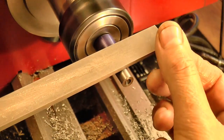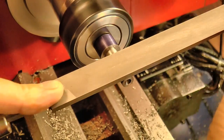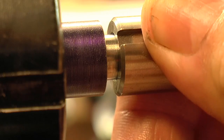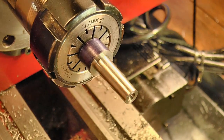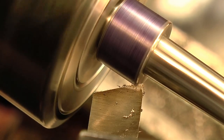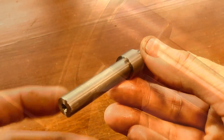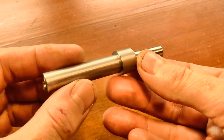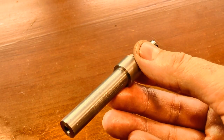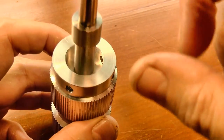The size is about right, but the surface finish could be a lot better, so a quick touch with a mill file to smooth out the tool marks. And the fit is excellent. A light chamfer and it's done. The steel shaft is a lot harder than the aluminium, so it will wear the bore a little over time, loosening the fit a tiny amount, but I don't think it'll be a major issue.